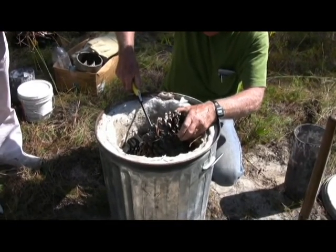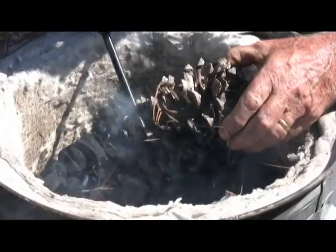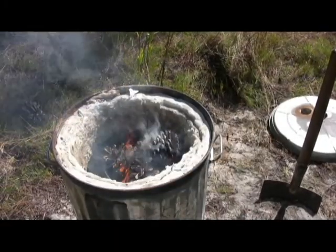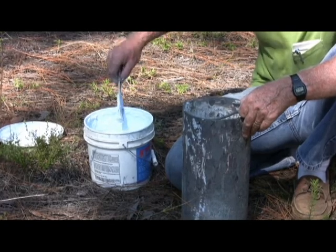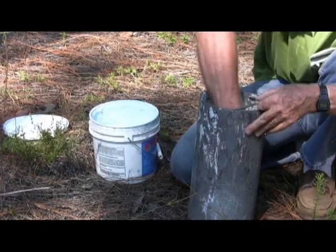Charcoal is rather difficult to ignite, so we use pinecones as tinder to get it burning well. The steel crucible must be protected from heat and corrosion by molten metal by painting it with boron nitride, a material that is not wet by molten metal.